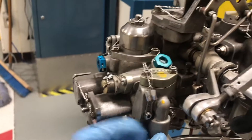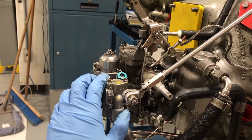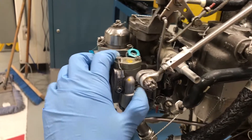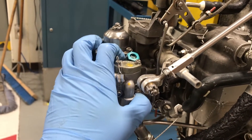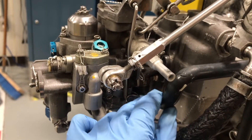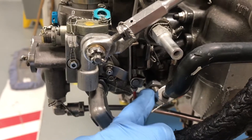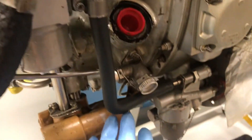The fuel comes into the metering section of the FCU. As this is a PT6-41, it cooperates with the hydro-pneumatic fuel control unit — it uses a pneumatic method for governing the fuel output. There is a P3 pneumatic line input to the fuel control system; it's the P3 governor, connected to the last stage of the compressor pressure.